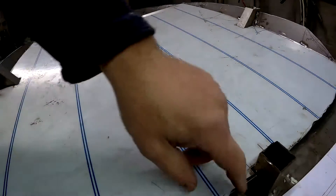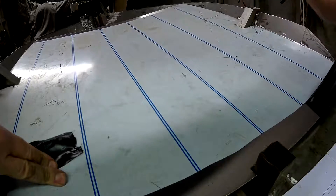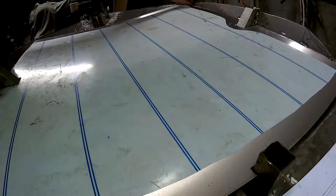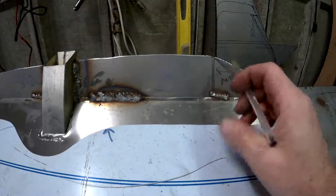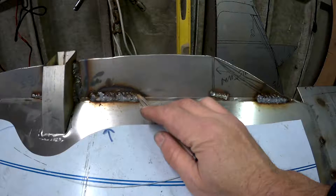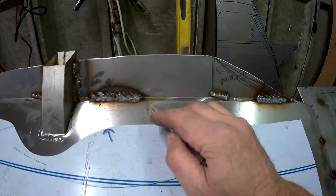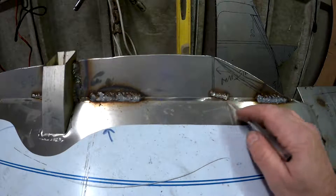I'm going to weld this in place. I've run a knife along the protection plastic — it means I stop too much weld spatter from going everywhere, since the anti-spatter spray is quite toxic. Here we've got a join from the floor panel up to the stainless steel of the tank, and then the steel of the hull. I can weld directly using 309 LSI wire from the steel, across the 0.9mm stainless, to the 2mm stainless — welding three pieces with one weld. It works quite nicely.